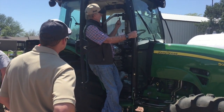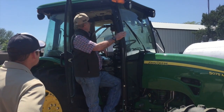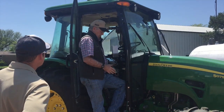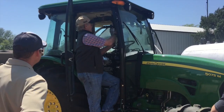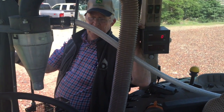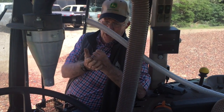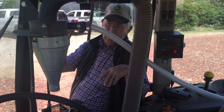The air is coming in and the dirt is coming in this way and it goes on up into here. It's a wiper in case you're in really wet or sticky soil that wants to stick. There's a fan here that'll actually put a little suction on this end right there. We've got two readouts right here — one is telling us the RPM of the airlock and the other is telling us the RPM of the roots blower so we can see that it's operating properly. If you get a rock — and you'll occasionally pick one up — it goes into the throat and if it didn't quite make it into the airlock before the flap comes around, it'll stop it. I can hit a button here and reverse it to kick the rock out and go forward again.